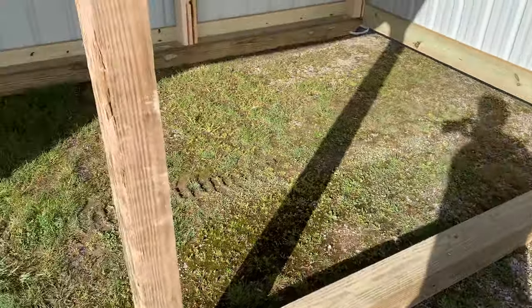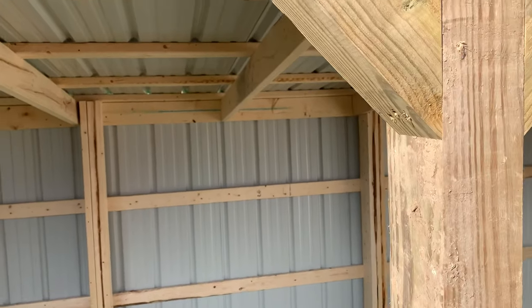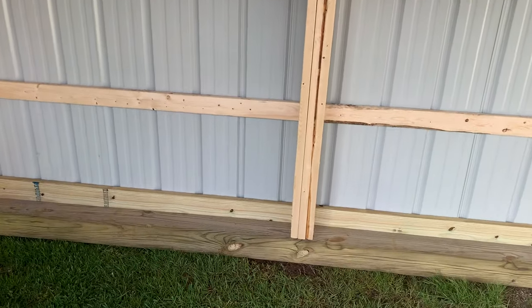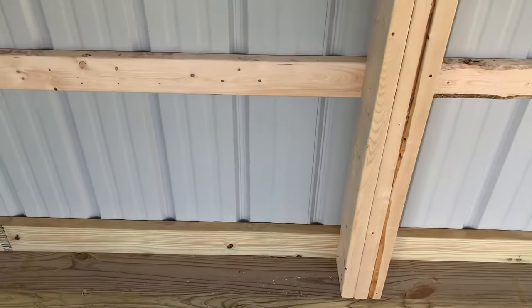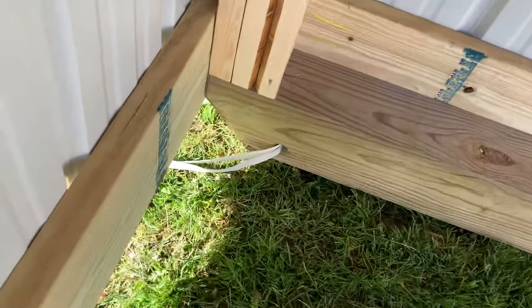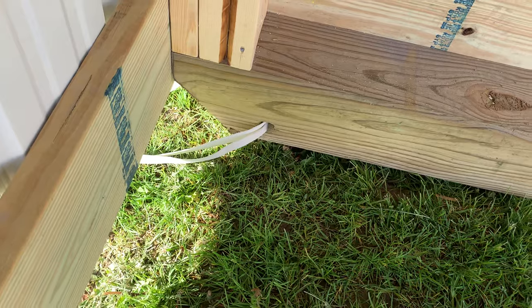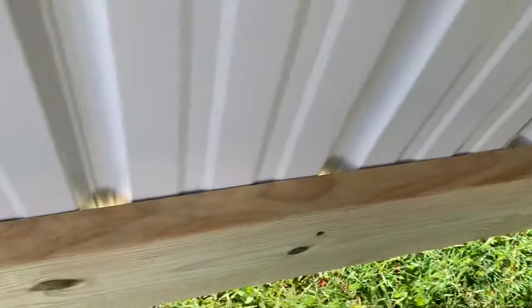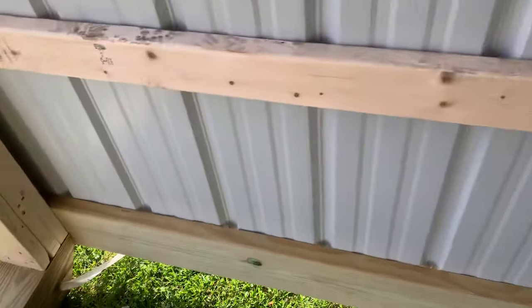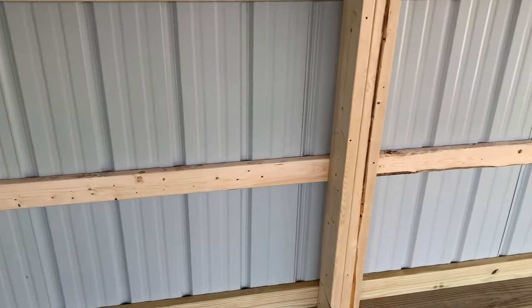You can see we put a 6x6 post right there, and then we also put a 4x6. You can see how we do the knee bracing on that. We glue together 2x6 SPF on the back here. There's a 6x6 post in the back and you can see how that's spliced up — it's like a ski, so you can move it and pull that. We glued those 2x6s together and put them on the back.